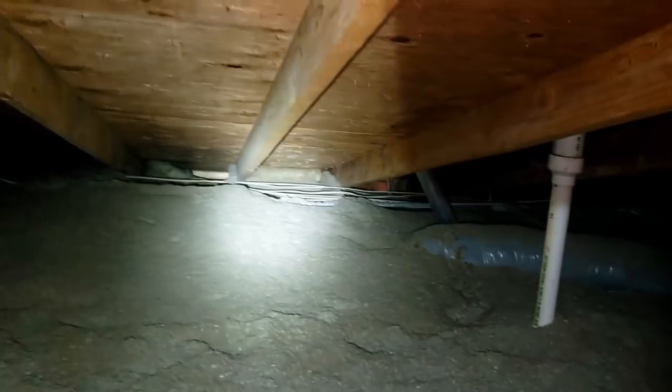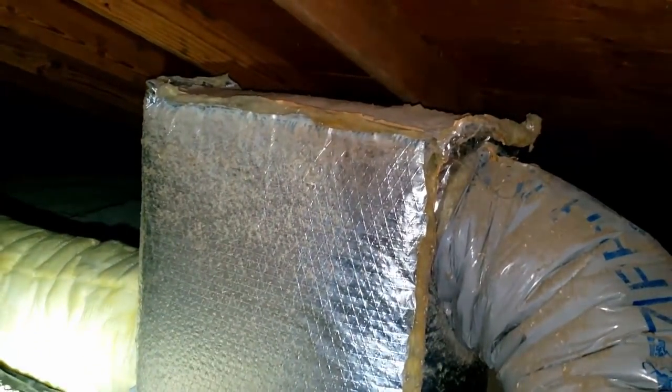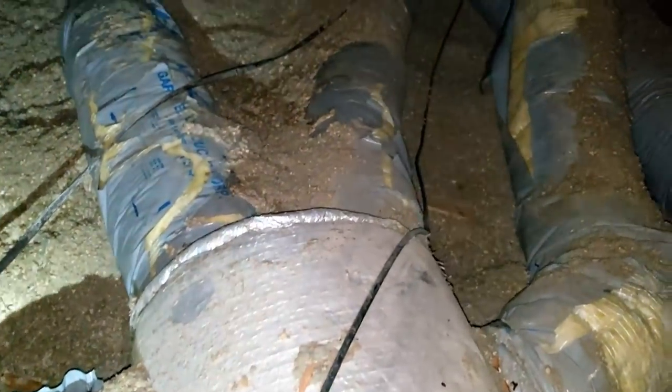There's another return and it's all messed up. That 90 on the side doesn't look good either — going to be real fun getting down in there. Looking at how they did this ductwork, there's no way our people did this; this must have been existing. This is some hacked-looking stuff and you can tell the cheap materials they used have just deteriorated. I've never seen anybody run it around to the end and then split off the end of a round duct — this is all return here.